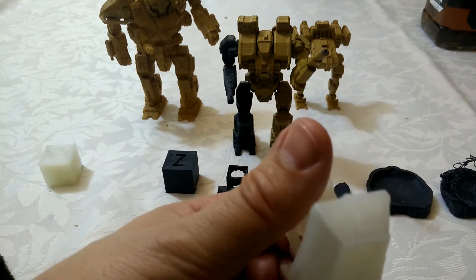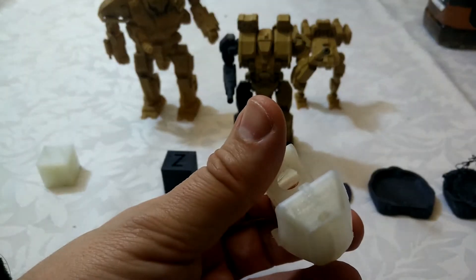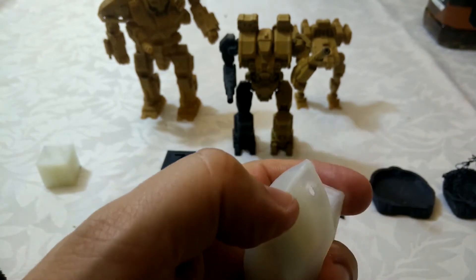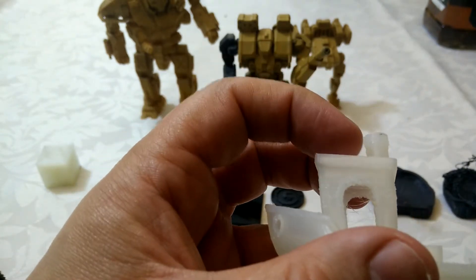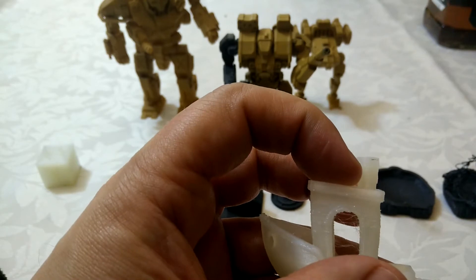The lettering on the back is not that easy to see, but the layer height is pretty good. There's a slight rough edge here, but not bad — I haven't done any cleaning up. There's a little bit of stringing, and it did go wrong at the top. I believe this is because the PLA was a bit too hot.